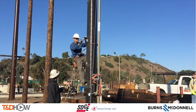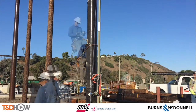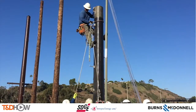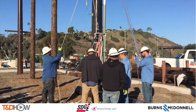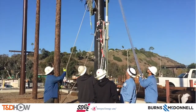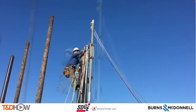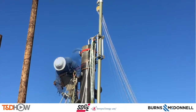Now we see the process Eddie just described, starting with the linemen going up the pole, putting steps in to climb up to the top of the existing second section. You can see them raising that cage, which will be used to raise the pole gin higher to install the next section. As he receives the cage at the top, it clips right in and is then strapped in with the two orange straps to hold it in place.